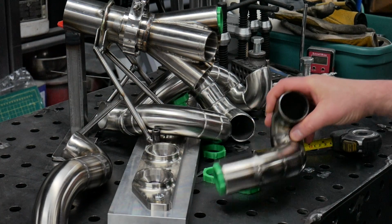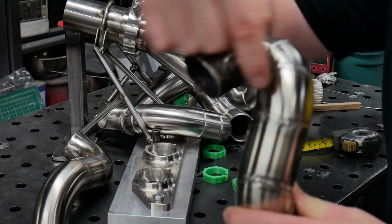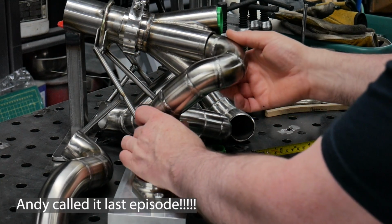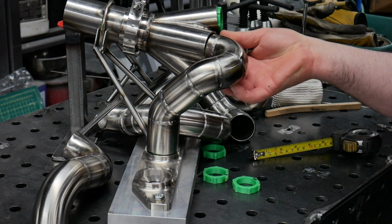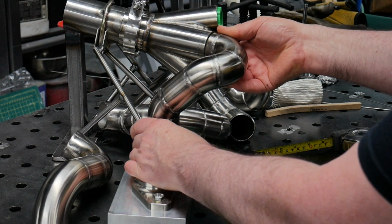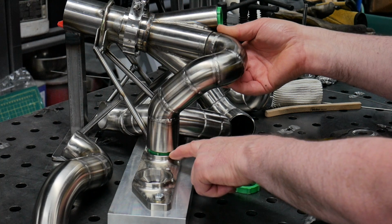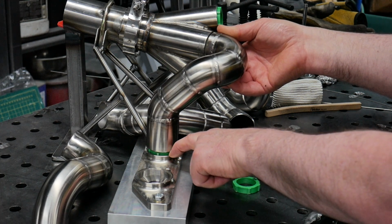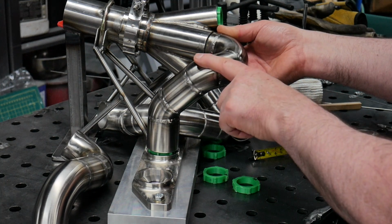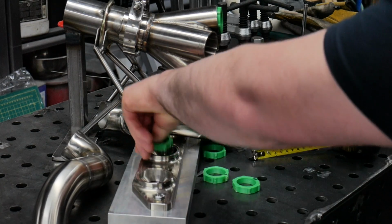That's fine. But these tubes that turn around and then go down, they'll shrink. So this one's too short now. Oh, the endless tribulations. I'm now a few mil short down here at this end. It's really no big deal, but I just overcooked these joints a little bit too much. I hit them a little bit too fast, or I hit them with too much amperage.